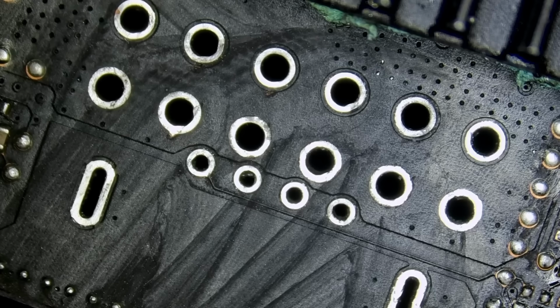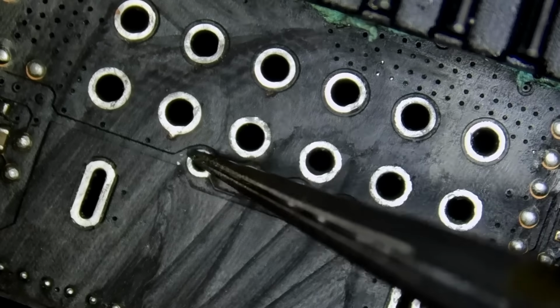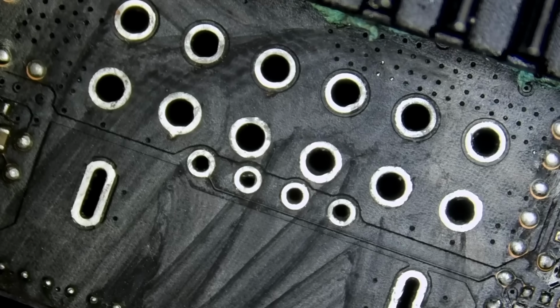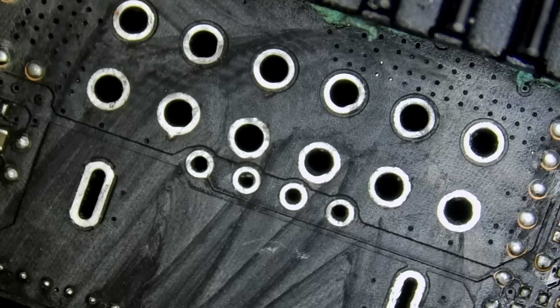Let me grab a replacement connector. And there are two types of replacement connectors. You have the regular 12V HPWR connector, and you have the ACES one. ACES one is different. For ACES, because ACES want to be special, they decided that the four holes that you see here, they're going to switch and put them on top. So the normal 12V HPWR connector will not work. You see how the four pins are from the bottom?